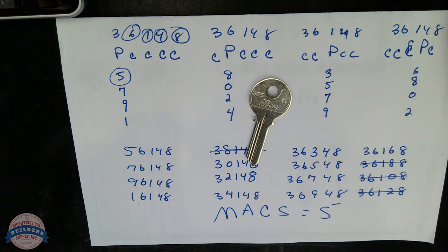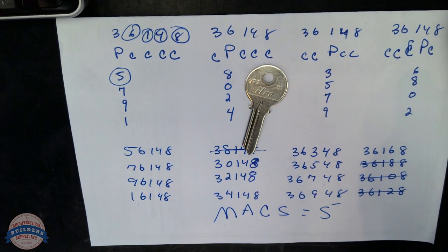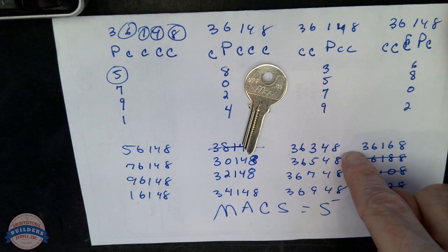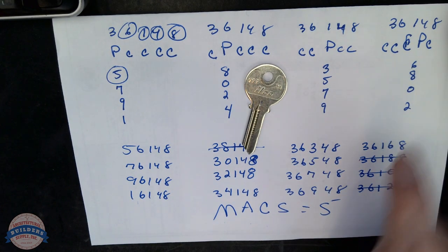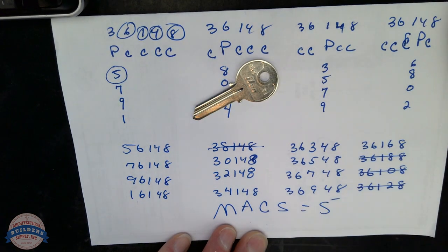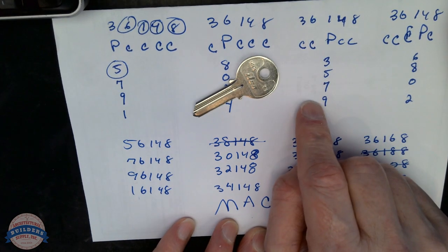And I don't know what happened to the locksmith who did that work, but you can bet they got to the bottom of how his key operated per unit. It was a multi-floor building. He thought he walked up 3 flights of stairs. He only walked up 2. And he put his key in and he went right in. And that's getting something down here wrong, is the bottom line. And it was probably total position progression to begin with. So there's master pins in every chamber.